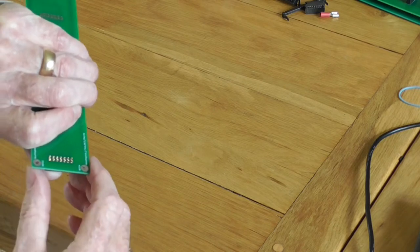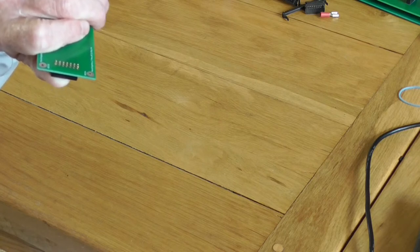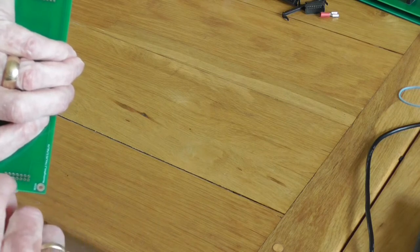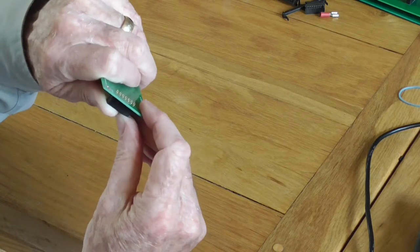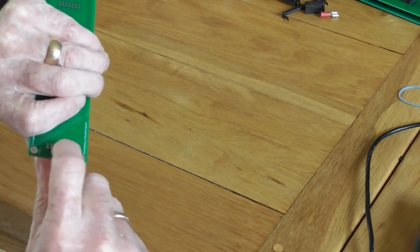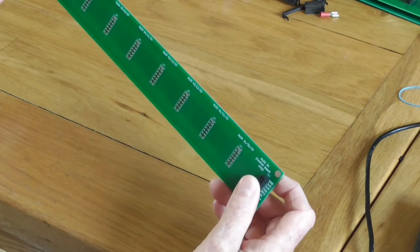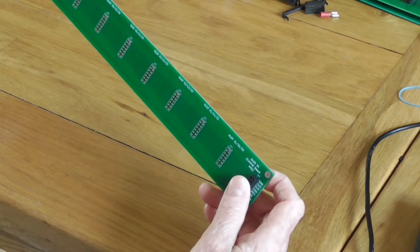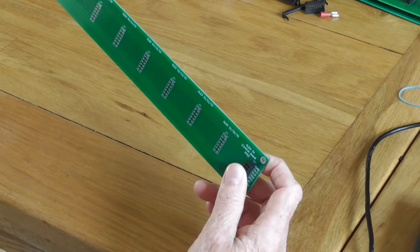To solder them you need a soldering iron with a very fine conical tip and 60/40 solder. You can use lead-free solder if you wish, but the size of the solder core is also important — it must be 0.7 millimetres, because these are quite fine to solder. You need to solder 14 little legs and make sure the socket is straight and upright, with every leg soldered to its connection point. You have that job to do 12 times on the central board, but once you've done a couple you'll feel quite comfortable — as long as you use a well-illuminated place and a really fine conical soldering iron bit.